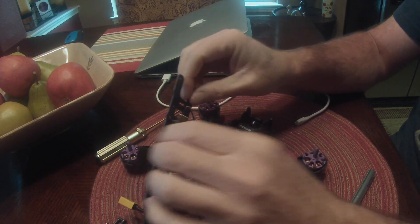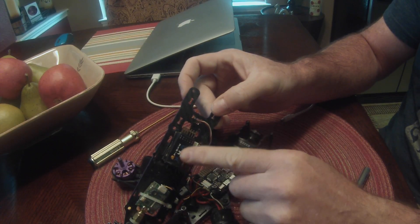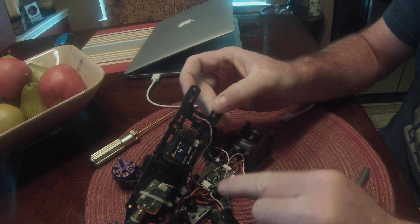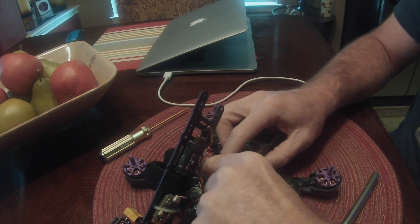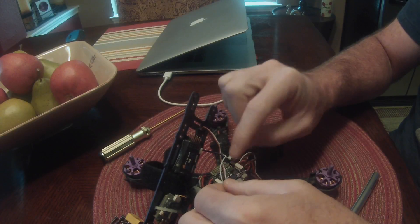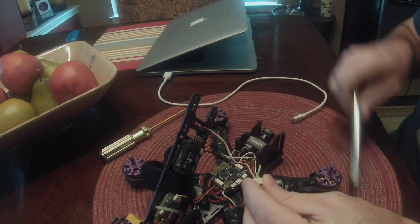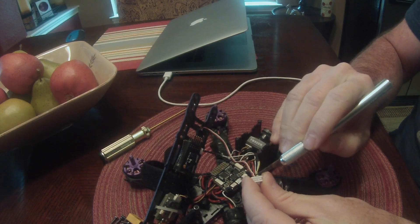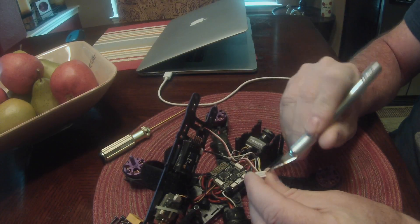The original wire from the previous video was coming from the X4R receiver on the fourth pin and going to the UART. Instead, you're going to hook this into your main receiver cable that comes from your receiver to your UART. You'll notice here you have three wires — BangGood left these three wires and cut all the others off because they weren't needed.